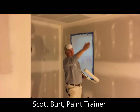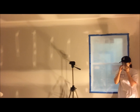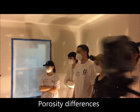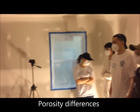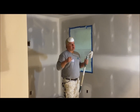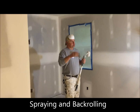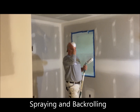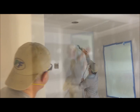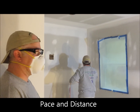When you spray across these surfaces, you're spraying the paper facing the drywall and you're spraying across the joint compound. The joint compound is going to want to suck it in a little bit faster than the paper, so the roller's job is to kind of equalize everything as it's happening. The sprayer guy always goes first, makes a couple of passes, and the roller guy follows and keeps it out. It's really important to be consistent in how fast you move and how far away from the wall you are.